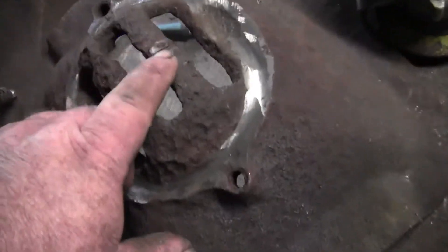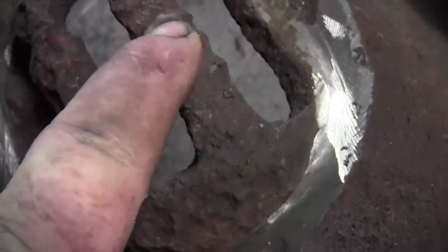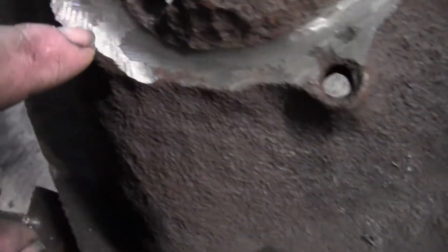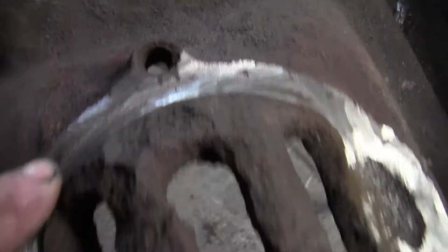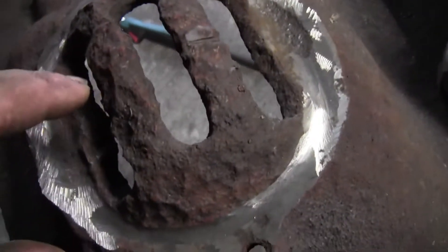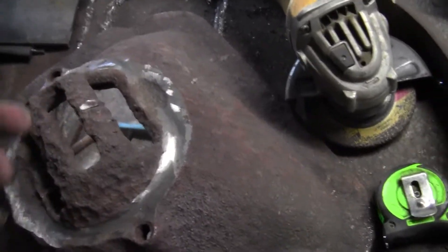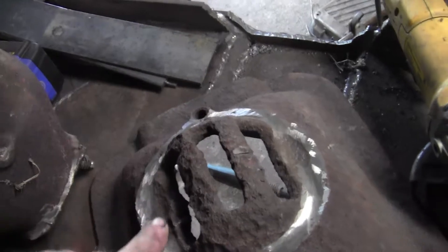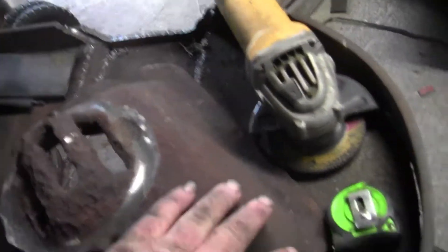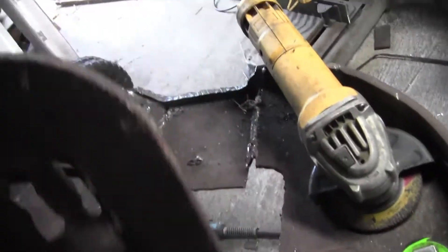What I was figuring on was there's a crack here, and there was another crack I just saw when I cleaned it up — right there. There's a crack there, so this fire pot is actually not in great shape. It is cast iron, so it really can't be welded easily — I mean, we can weld on it with nickel rods — but I'm not gonna do all that. So what I think I'm gonna do is not worry about the clinker breaker.